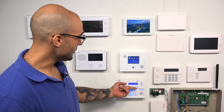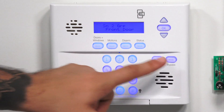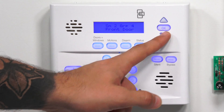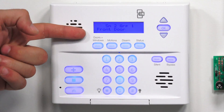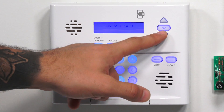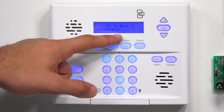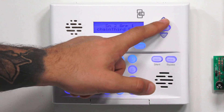As you can see, you can enter really any group number, so you want to make sure that you pick the right one or your key fob may not work as expected. Let's set it to be an audible police panic, so we'll press down — that's the direction we want to go — and it's going to toggle between the different groups. Group number one is what we want, so I'm going to click OK. Then it's going to let us change the alpha for the zone — we want to name it what it is. If we look for the key fob, we have a preset name called 'keychain,' so we can click OK. You'll see a cursor opens up next to it, which you can click to add a second word to the descriptor if you like.